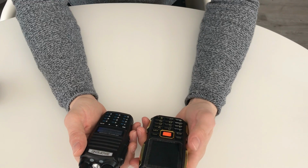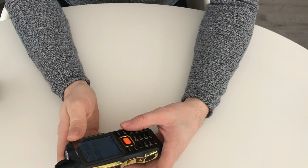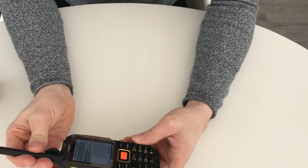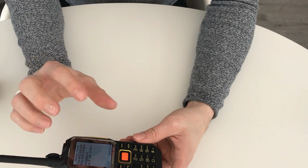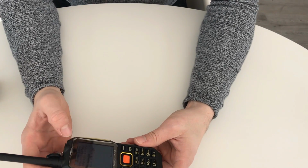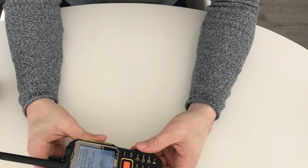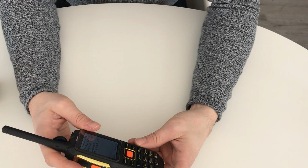So yeah, those were the main issues with this, which basically made me decide that it was rubbish. Firstly is the constant interference. It's actually behaving itself today, but constant interference on a lot of frequencies actually jams up the usability of it, because you've got to stop that notification from coming through. So what I kept doing was just unplugging the battery. And secondly, the PTT is dodgy. It doesn't always key up first time. It's intermittent keying up, and just the overall cheap feel of it.